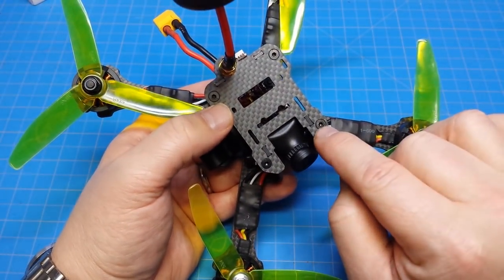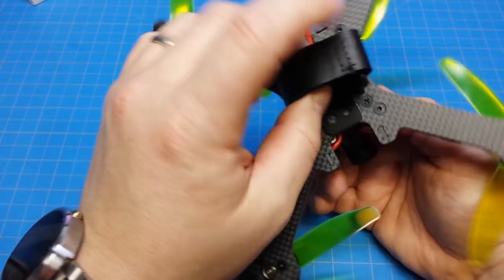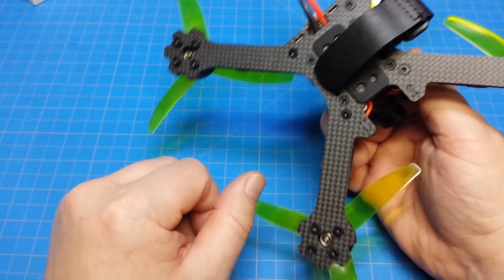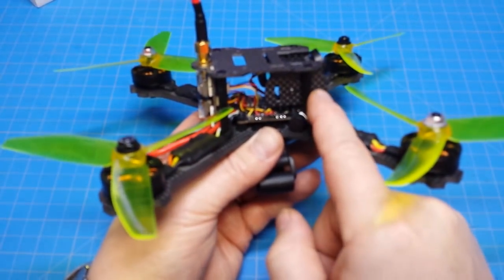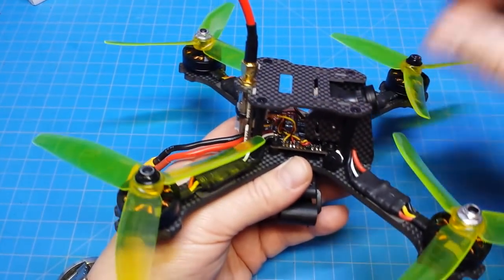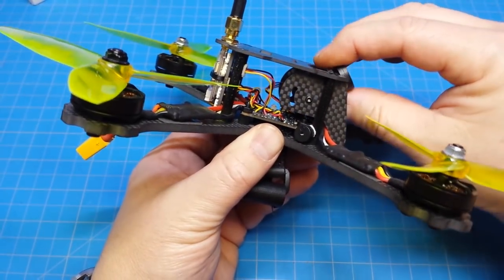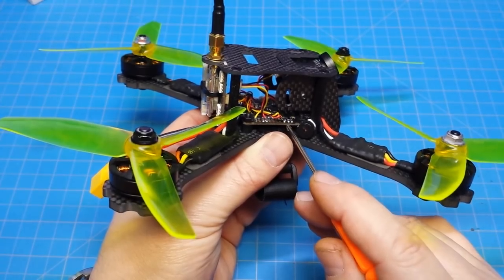It's a detail, but I'm not crazy about these flush-mounted hex screws — they have those in the center on the top and the bottom. We also have a rubber pad here to keep our battery from ejecting quite so easily. We have a very small center section, and because of the way the camera is mounted — this isn't a stretch X — the camera actually goes over the top of the board, especially if you do steep camera angles. So your stack has to be extraordinarily low, and pretty much an all-in-one board is about all you're going to get in here.